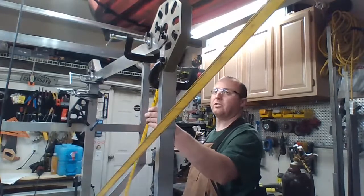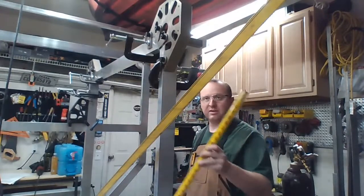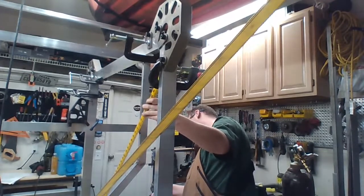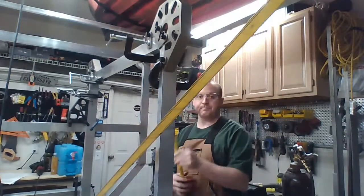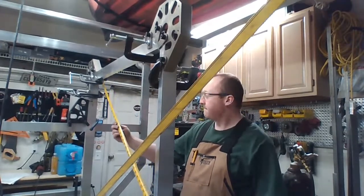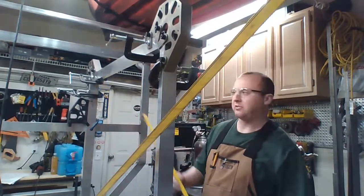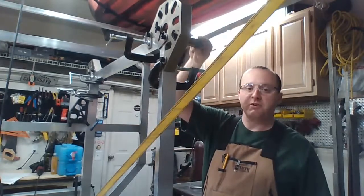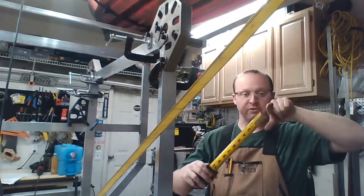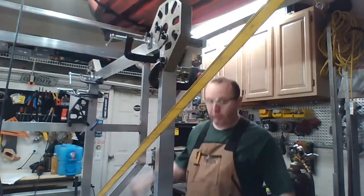That is a lot. You know, I don't like measuring off that. I'm gonna measure off the 1 inch. That's more steady. I was just hitting this up against the corner, which I could pivot. So I'm gonna try to get off the single points, which is always better. Almost a perfect 51. Yeah, that's what I thought. Both these are 51 to 16th, so that's fine. I measured now off of the 1 inch posts. So instead of getting a random spot in here where this is catching on, I got a single edge, so it's more accurate. Okay, so that is square in this plane.